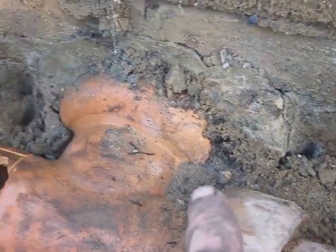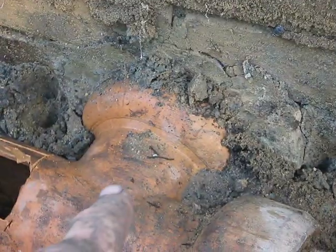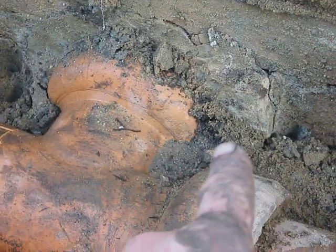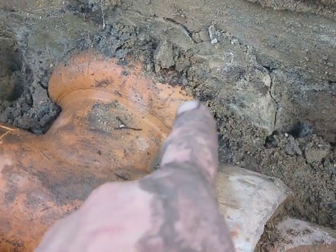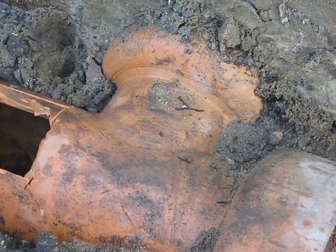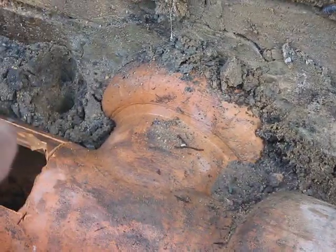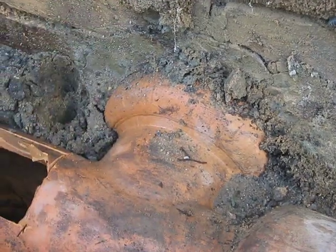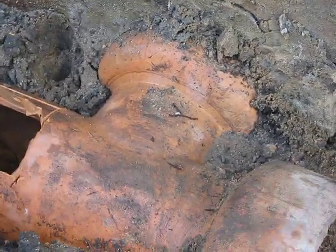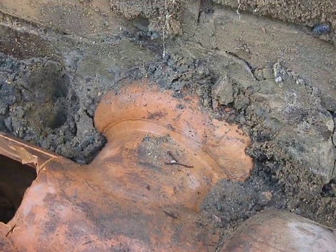It appears that what's happening is there's a tree root on the underneath side of the pipe going under the house, with roots bending around and growing up under the house in the PVC pipe. That's good news — all I have to do is dig away the dirt, seal it up with cement, and work on the PVC under the house to clear any blockage.